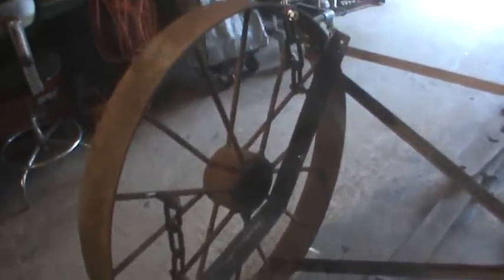As far as the wheels, I'm going to leave the rusty parts rusty. I'll just hit them with a hand wire brush to knock off the dirt. I'm going to take the brackets off, sand them down—not so the rust is gone, just to clean them up—and probably do the urethane on the brackets after I do all the welding. Then I'll seal them the same way to match the bench. Chains will stay rusty. Off to breakfast.